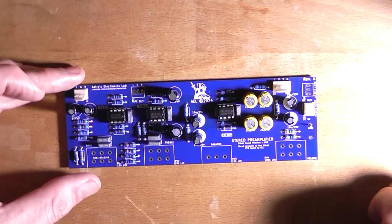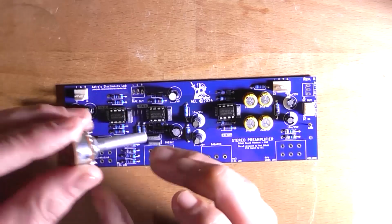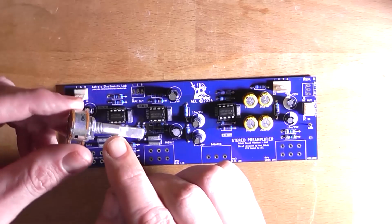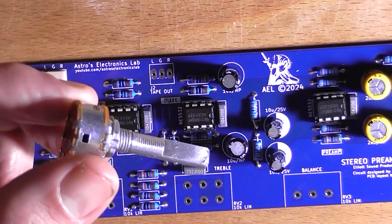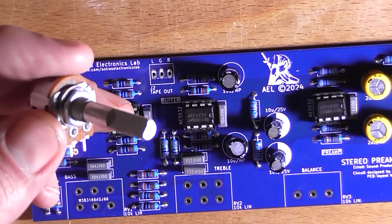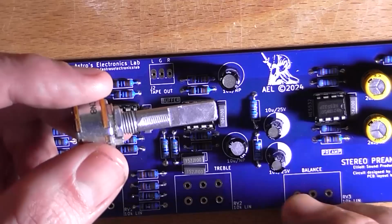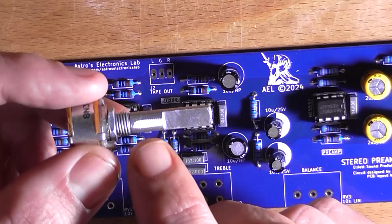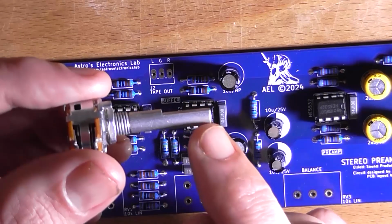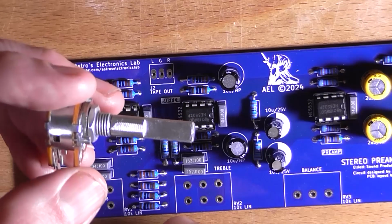So now I have to deal with the potentiometers, which is going to be my next challenge, trying to file these shafts down. I already attempted it the other day by mounting it into a G-clamp on the desk, and it wasn't really very successful. I need a vise, so I'm going to buy one because I need it for other things too, and then I'll try filing it down again, because at least then the vise can grip the shaft at the end, and I'm not worried about this end of the shaft being marred by the vise teeth, because that's going to be cut off anyway, shorter to accept the potentiometer knob.